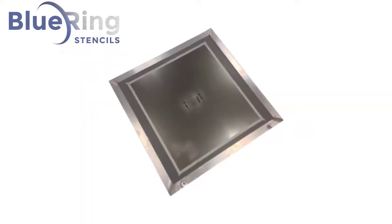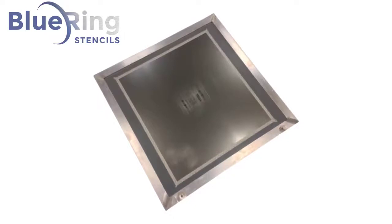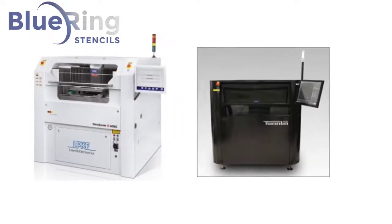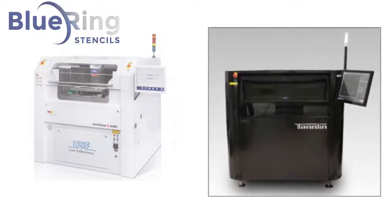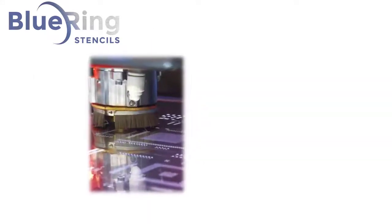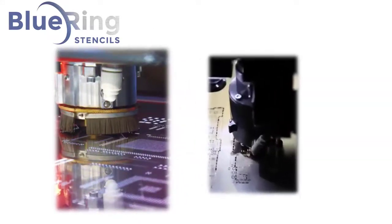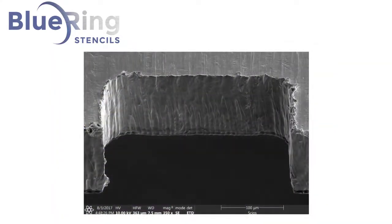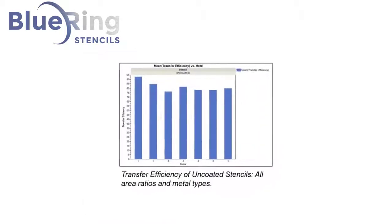So initially the stencil industry focused on stencil performance by improving the laser systems used during the stencil manufacturing process. Around 2010, fiber lasers replaced YAG lasers, and more accurate linear motion systems were built into the equipment specifically created to cut SMT solder paste stencils. These improvements created smoother aperture sidewalls, which resulted in better solder paste release.